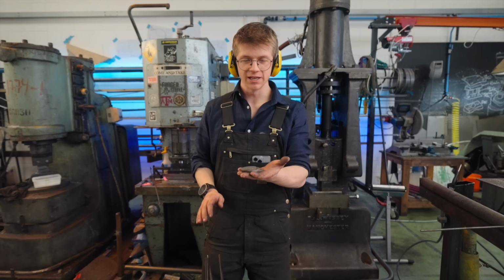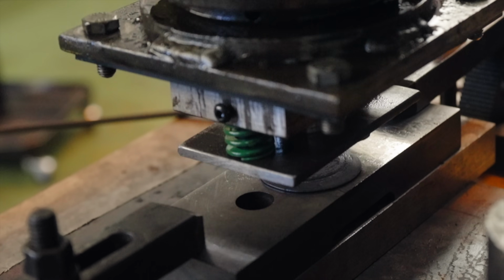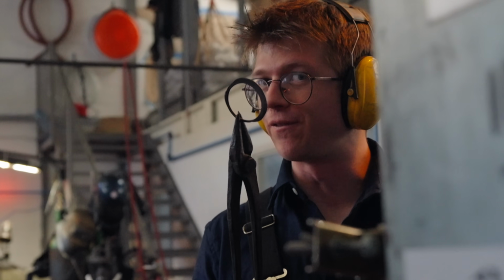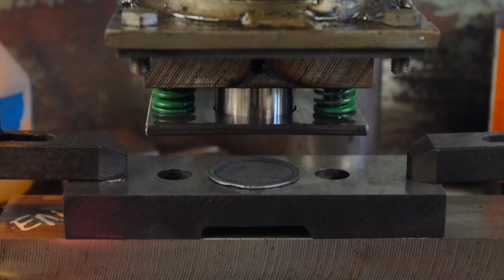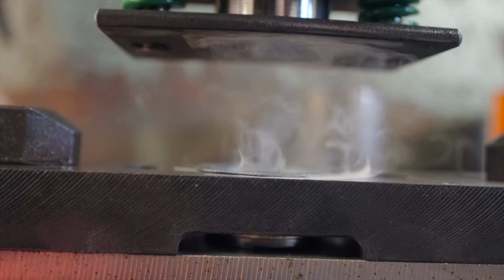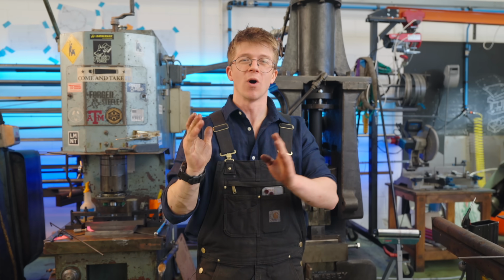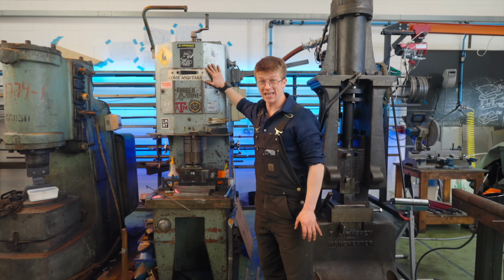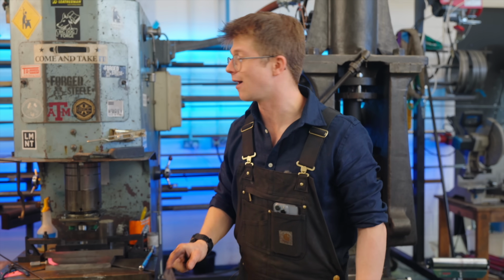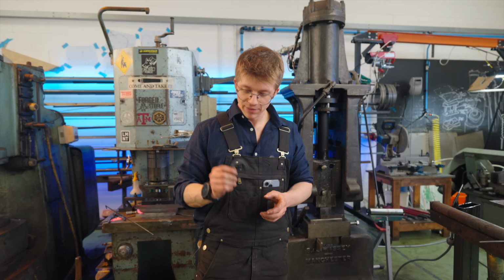One success is one thing, see if we can replicate it. Fucker! No! Yes! Flashing number 2, took more effort though. Oh, yay! Come on, baby. Yes! We appear to be absolutely right there in the margin between this working and not working. Even a smidge less pressure from that press, and I don't think we'd get any of these things clipped. Ever so barely enough to clip them when the flashing is thin enough. Real bugger that it's not more consistent than that. But I think we can do something with it.